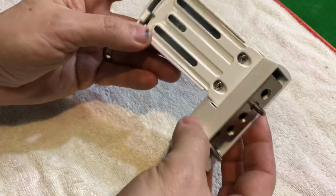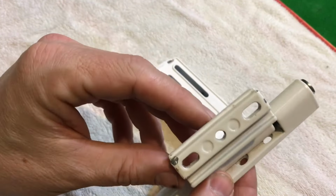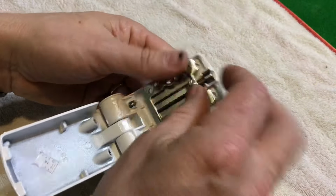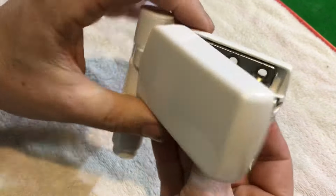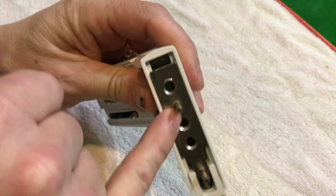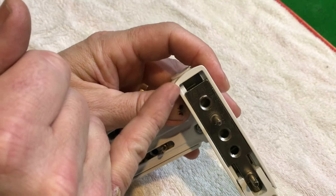These new flag hinges are so much more adjustable. You can adjust these in every direction, unlike the old ones. On the old one there, the only up and down height adjustment you've got is within the screws on the bracket there, which is not very good. This new one here, you've got an adjuster to move the door in and out on that bracket there. You've also got on the bottom here a height adjuster for this hinge here, to this bracket here, to move this up and down. So when we're putting it in, to start with, we need about 5 millimeters between the top there.